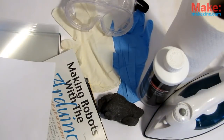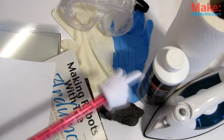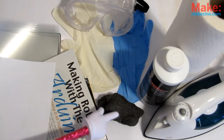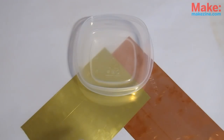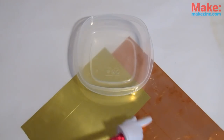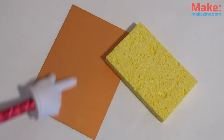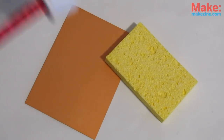Today we'll show you how to do both with Super Simple Copper Etching. Let's go! For this copper-tastic build, we will need: eye protection and gloves — rubber, latex, or any kind will do — ferric chloride etchant found at some electronic stores or online, regular printer paper, printable plastic film or really thin glossy magazine pages, and access to a laser printer or copier, a clothes iron, some fine steel wool, and paper towels — it gets messy! For making jewelry, we'll also need some solid pieces of copper or brass found at fancy art stores, and a plastic or glass container that can fit your piece to be etched. For circuit boards, instead we'll need a copper-clad PC board and a brand new kitchen sponge, for the sponge etch method pioneered by our friend Jim from TechChop.